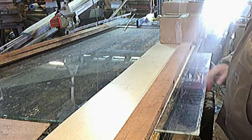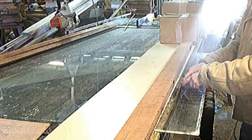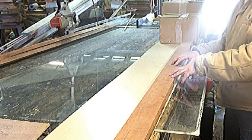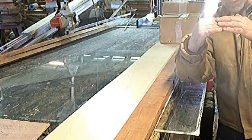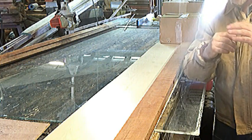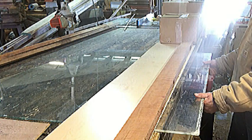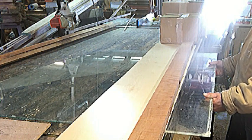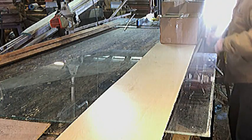Now I'm putting a little bit of weight on this. When I bring the glass, I'm going to bring that scoring right to the edge of the table. I want a little bit of weight on top of the glass so it doesn't want to bow. If it bows, the crack might go one way or another depending on any defect in the scoring. This just helps the glass break evenly all the way across the face of the glass itself — it evens out the weight distribution.